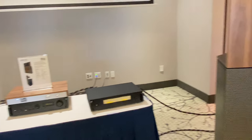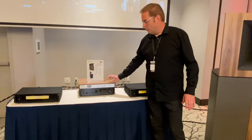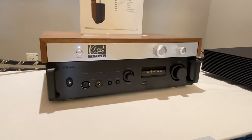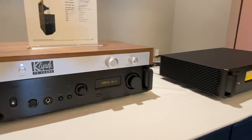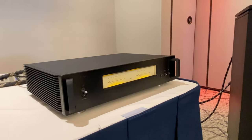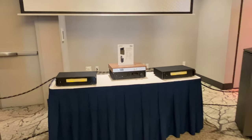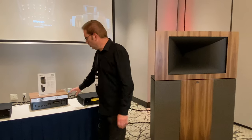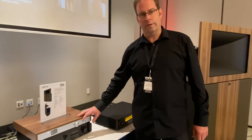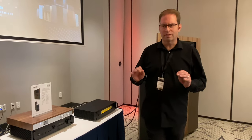The active network that comes in the box is actually a DSP with crossovers, so you cannot run the system without two amplifiers. In this setup, we're using a Teac network pre-amplifier driving into two 701 series amplifiers — one driving the low-frequency cabinets and the other driving the high-frequency cabinets. The only two controls on the front of the unit are gain for low frequencies and gain for high frequencies, so you have very little to adjust other than tuning to the exact sound you're looking for in whatever environment you're setting them up in.